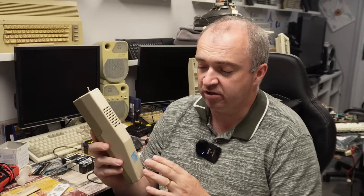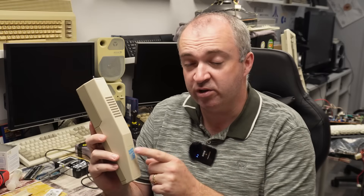Welcome back to the Super Turbo 28. Last time we discovered that this budget sidecar accelerator for the Amiga 500 is faulty. When plugged into the machine, all you get is a black screen. It was purchased from Ami Bay - it belongs to another local Amiga enthusiast who bought it knowing it was faulty, sold under the guise of possibly having a bad clock. We were able to prove the oscillator is fine - it is producing its 28.5 MHz clock and that is making its way over to the CPU.